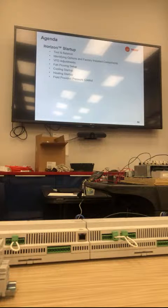What's happening there is when we're going through testing and they're doing cooling, our testers override it to 100% and then turn the compressor on so it's at full capacity. Then they turn the compressor off, it shuts down, and they don't go back and think about releasing that override. So how do I get rid of it? You want to go show them how to get rid of that real quick? Yeah, I tried to release it and it comes right back.